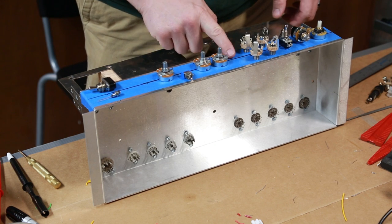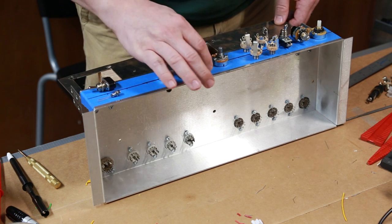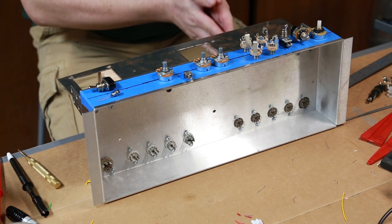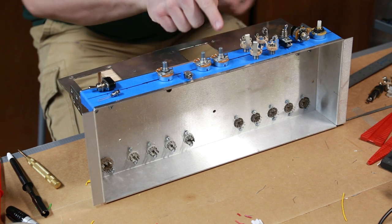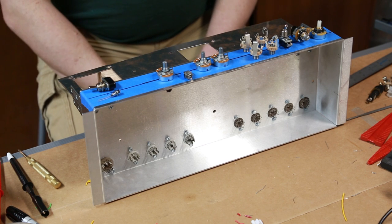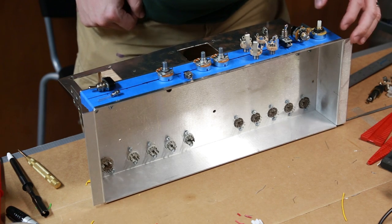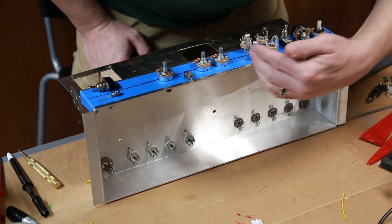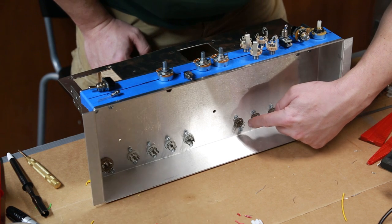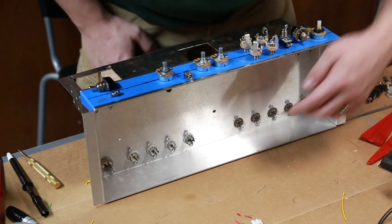I'm just trying to quickly decide if it might be better to swap these places so we have the inputs there. Remember I told you where the transformers are going to be — I have the wire for the output transformers coming down right through here. I'll try and keep them out of the way as much as possible, but I don't want them too close to the inputs. The inputs, even though they'll be shielded, are going to come in through here and across back into the back area away from where that output transformer is. This is the EF-86 preamp tube, and then these are the ones for the phase inverter, so I might be putting those too far away — it's going to be a bit tricky.